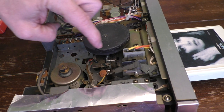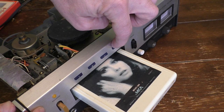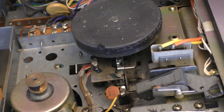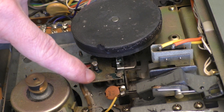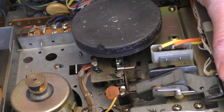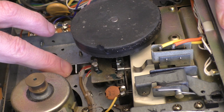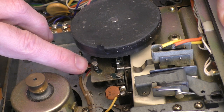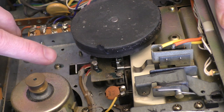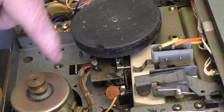Playing around with this, I discovered I need to change the belt. But I also noticed that the track changer wasn't really working when I stuck in the tape — the lights were stuck on track four and it wasn't switching tracks. Basically, when I push the track changer, it activates a little solenoid here that allows this platform to go up and down, changing the position of the head on the tape. It was stuck initially, but after playing around with it, I got it working. The platform is now moving — it probably just needs some lubrication due to age.